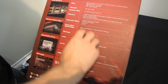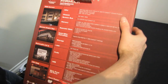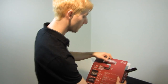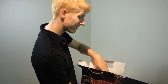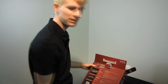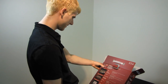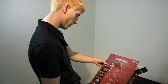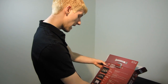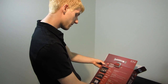We've got support for six SATA 3 6-gigabit-per-second ports, as well as an additional ASMedia controller giving us an external SATA 6-gigabit-per-second port. So the eSATA port on this board is actually SATA 3 at 6 gigabits per second — pretty cool if you had a super high-speed SSD as an external drive. We also have Intel Gigabit LAN, which is interesting on an AMD board, but Intel LAN is very well regarded. And there's an ASMedia USB 3 controller giving us four ports at the back and two at the midboard.